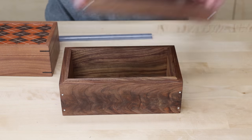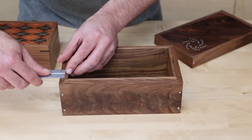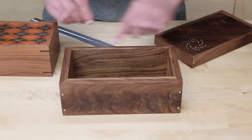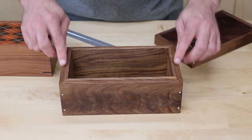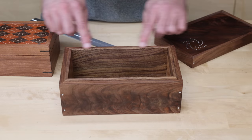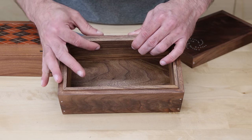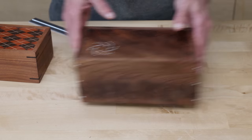With this box being about five by nine, let's look at the material thickness. It is about three-eighths of an inch thick, and then I added another quarter-inch thick liner on the inside. I did do a slightly thinner wall than maybe I would have done for a different type of box, but I took into account that I would put a liner in there — so now we kind of have thicker walls. If I would have made the walls super thick, it would have just looked a little bit too chunky.